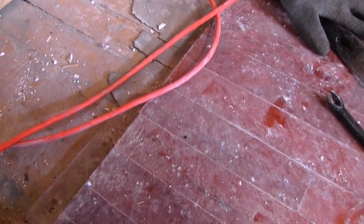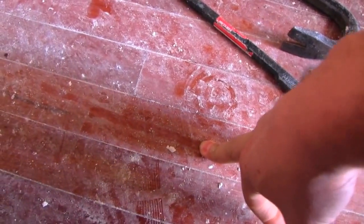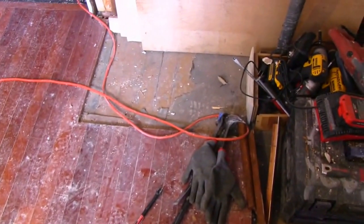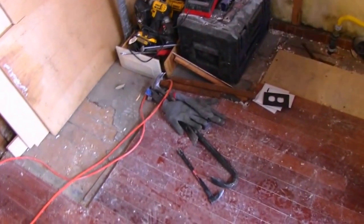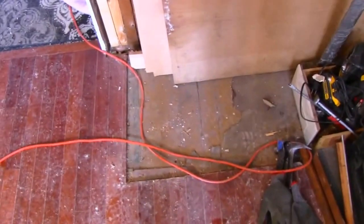It's very unsightly. So what we have to do is we need to manually go through every other board and bring it back so we can create a stagger. The problem is all of this is tongue and groove, and so it's all interlocked together, and we used a floor stapler to staple it down. So not only is it interlocked together, but it's fastened to the floor, and so it's no fun whatsoever to do this. I imagine this is going to take maybe half a day or longer just to do this portion right here, to make it look perfect. Obviously the objective is to make it look like it's part of the floor and not some after the fact patchwork installation.